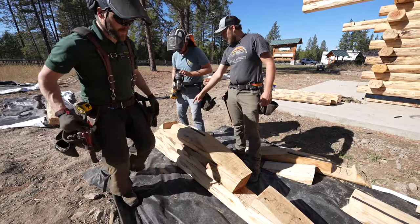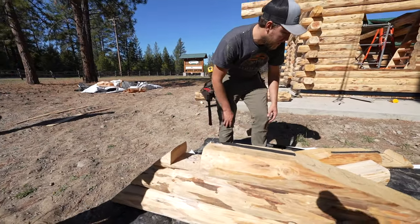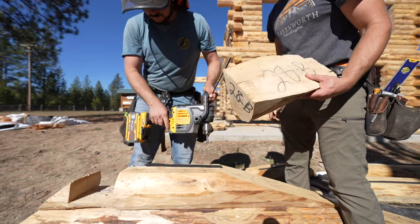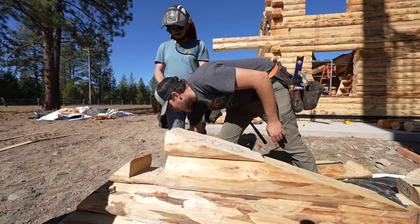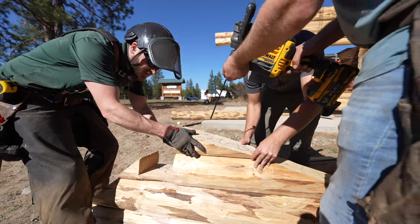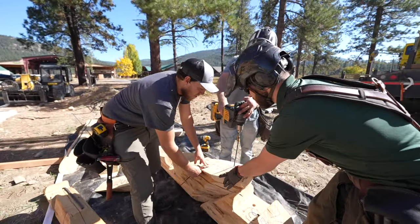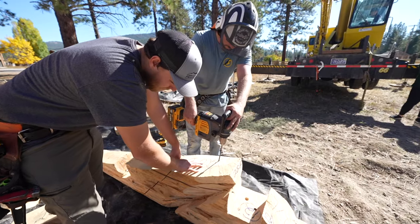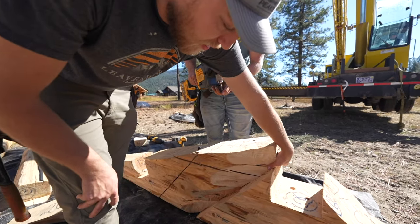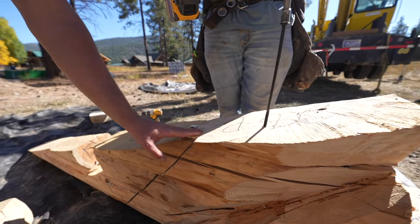And actually that is the ridge pole. This is the ridge pole tenon right here, or the ridge pole mortise right here. This last piece comes up like this, which is 28B right here. This will cap off the very top, which is right here. There's our entire gable. Hang on, it's actually gonna go that way, because this is put in after the fact here. You always wanna make sure this is flush, because this is not necessarily correct here. This is put in after this is cut, so always wanna make sure this is flush over here.